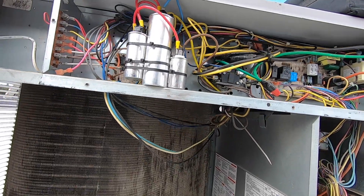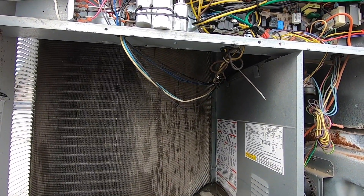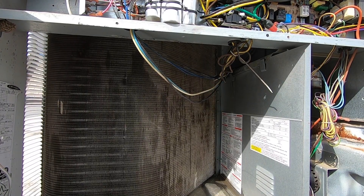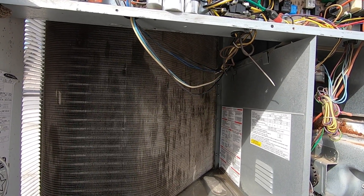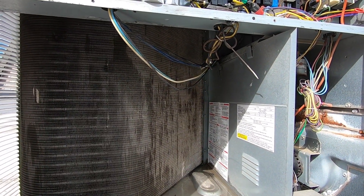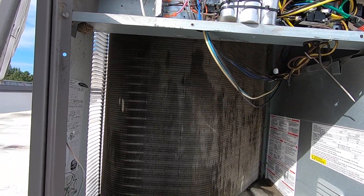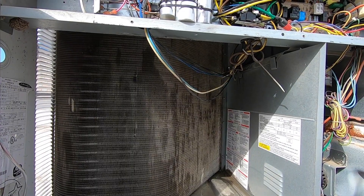So it's just a small tip. Showed up to the unit, he says it's not running. But before that, I remember him telling me the symptoms of the fan going off and on. Obviously you guys know the outcome of that. He didn't know what was going on - he's not trained to look into these details. But he knew enough to say why is the fan going off and on. So took the information in - didn't just change the capacitor. Just changing the capacitor, yes, we got the unit running, but it doesn't solve what he was talking about from the earlier times.